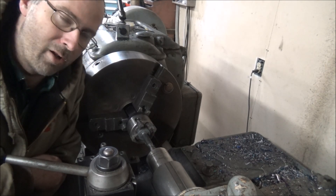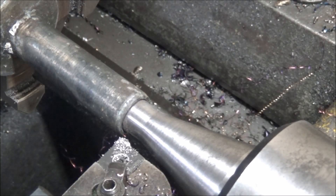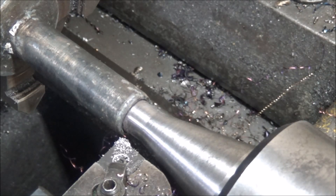I'm gonna fire this lathe up and we'll get to it. Let's see if we can't turn this crusty old tappet into something beautiful. I'm gonna touch off and see where I'm at — going down by tens and doing a wipe on the way back, that should finish it to size. I'm doing a four thousandths feed rate and at most a ten thou depth of cut.